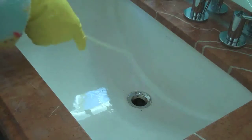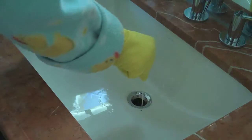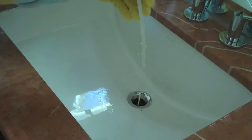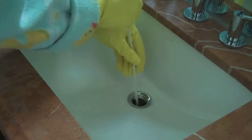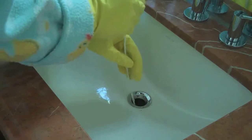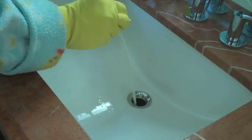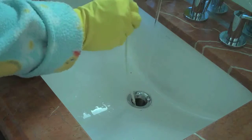Then you want to put the drain snake into the drain, turning one way or the other — clockwise or counterclockwise depending on your pleasure. And if it gets stuck, you can turn on the faucet for a bit as you keep turning.